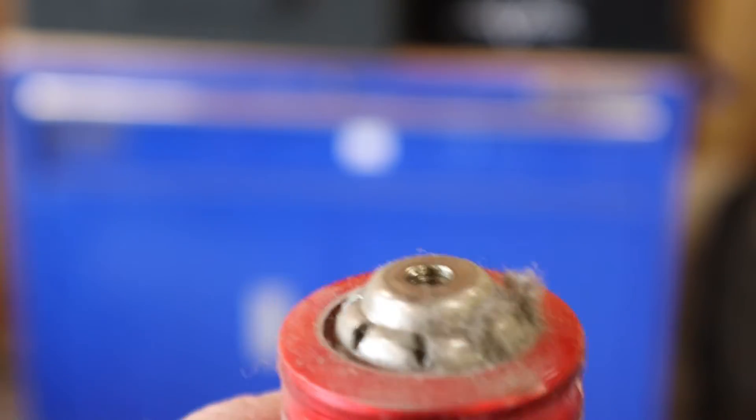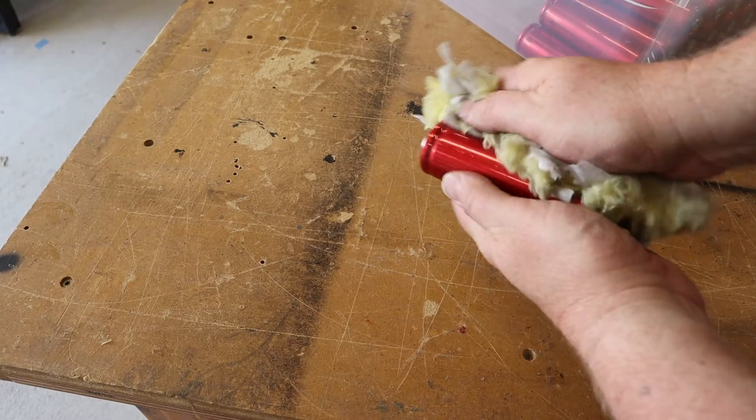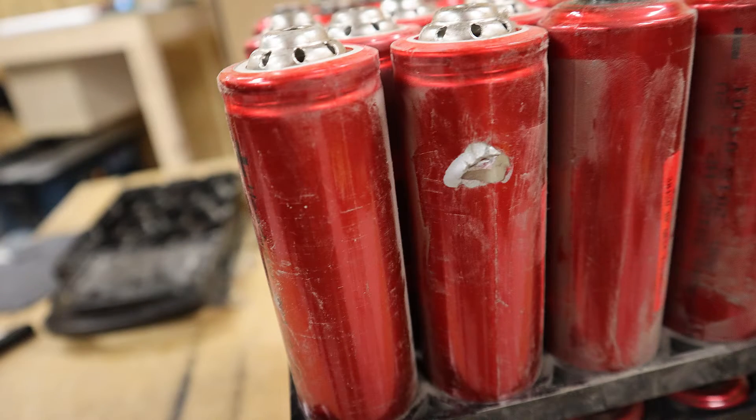These Superbeast modules are used, and they are going to be filthy. I found that I was able to knock the dust off with something as simple as a Swiffer. Earlier I mentioned those temperature sensors — when you pull those off, there's a good chance you're going to remove some of the outer insulation, that red stuff on the outside of the cells. So you want to apply electrical tape to any exposed metal.